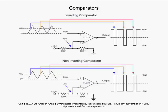Oh, here's what it is. You're going into logic circuitry with the output of a comparator. The chatter can be very fast. So in order to see it, you have to turn your scope sweep speed up a lot and look very close at the edge of the output of your comparator. Because where you think, oh, I should only be getting 1 transition, you might be getting 5. And so your logic is just not going to be doing anything you expect, because you're not getting clean pulses coming out of there. Well, how can we get clean pulses? Let's move on. We add hysteresis.